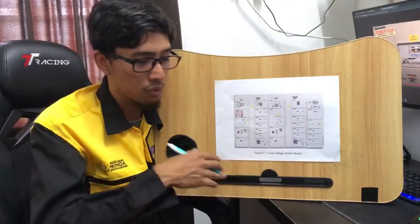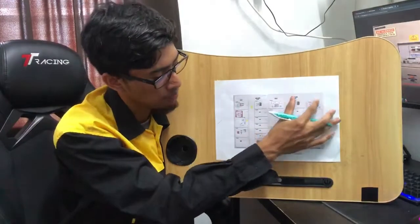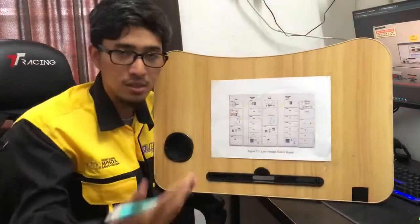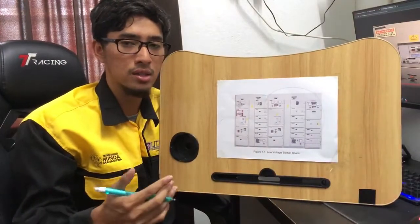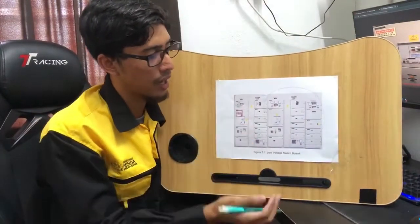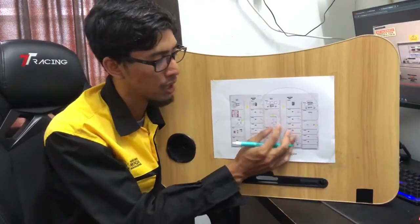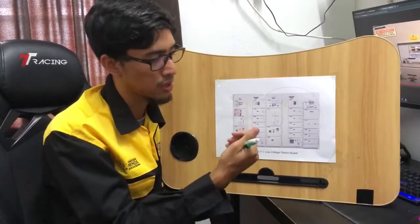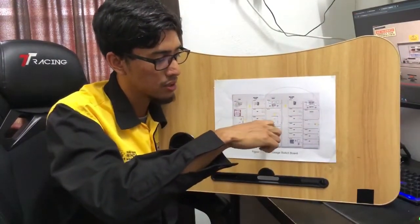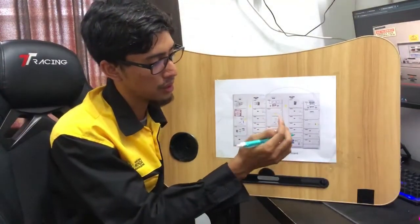So next we will repeat the same steps for the LVSB 2. We go to the next part, which is here. Same as before, we need to turn on the incoming supply, and then we go to the ACB part at LVSB 2. We take out the charging handle and turn until the status is connect, and then we pull it out.